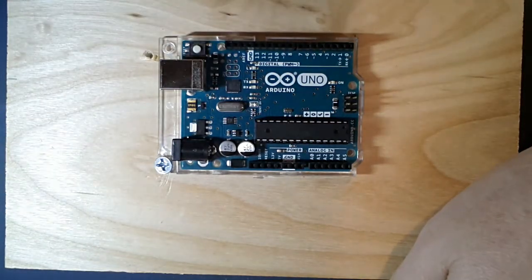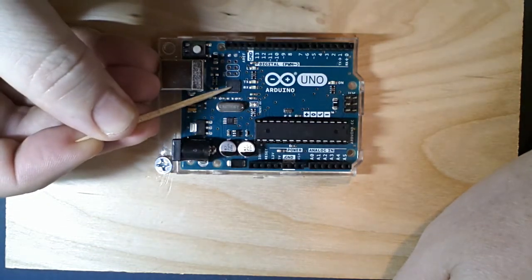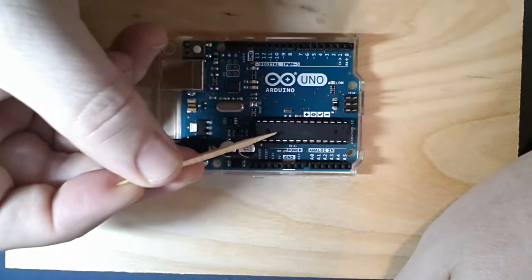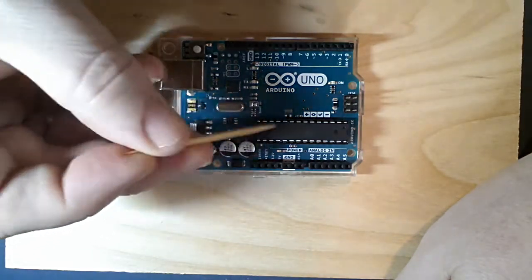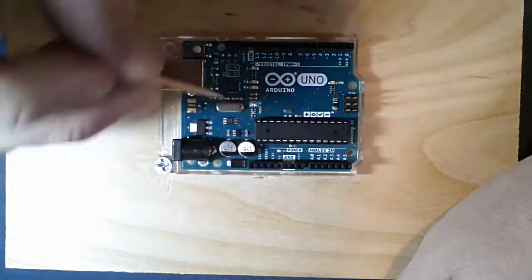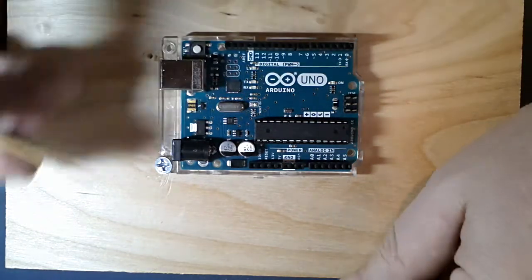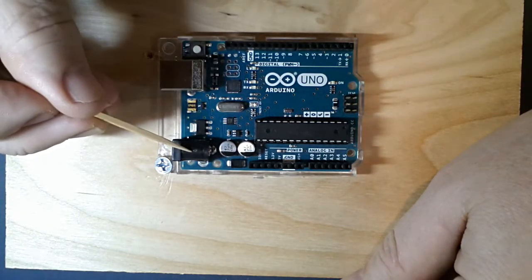There's a little microcontroller that Atmel makes which basically creates a USB interface between your computer and the main microcontroller. There needs to be some translation and logic level shifting, so this chip controls all that - it's the main interface between your computer and your target microcontroller.